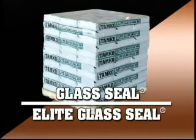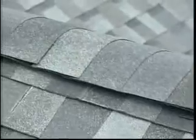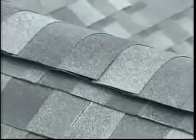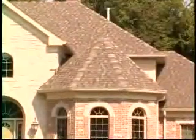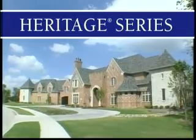Fasteners should be a quarter of an inch longer than the ones used for field shingles. Prior to installation, care needs to be taken to prevent damage, which can occur while bending shingles in cold weather.